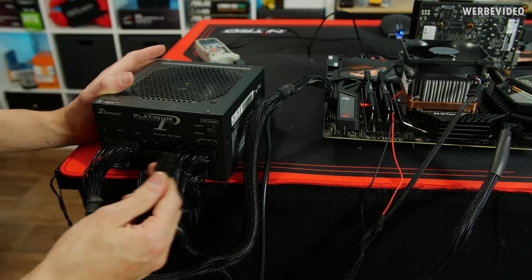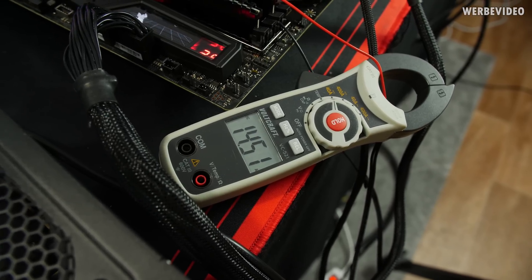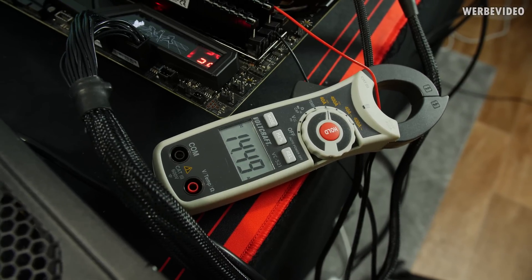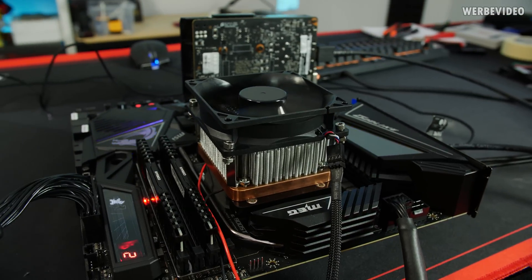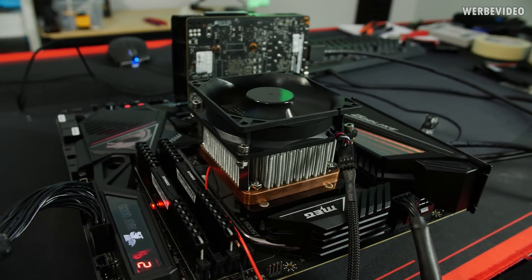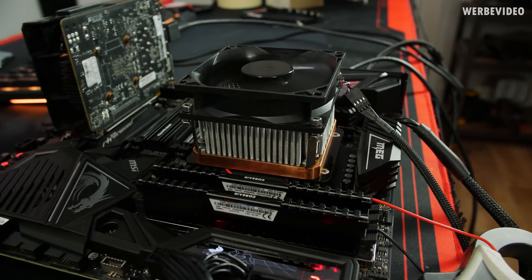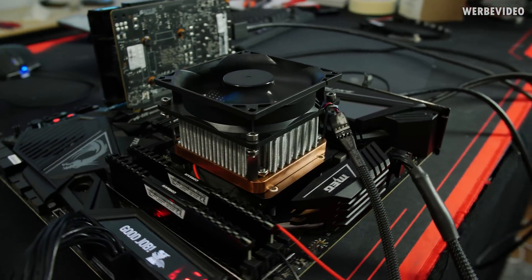Time to plug in the cable and see how it goes. The current clamp shows about 14.5 to 15 amps, which is about 170 watts of power draw just from the TEC alone — that's quite a lot. I'd be okay with that power level if it were a custom water cooling loop, but with this tiny air cooler I'm not so sure it can really handle that much heat. Let's see where the temperature ends up.